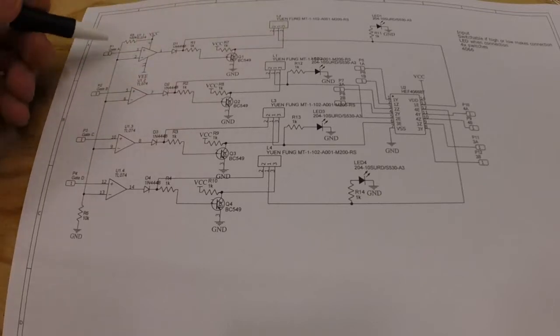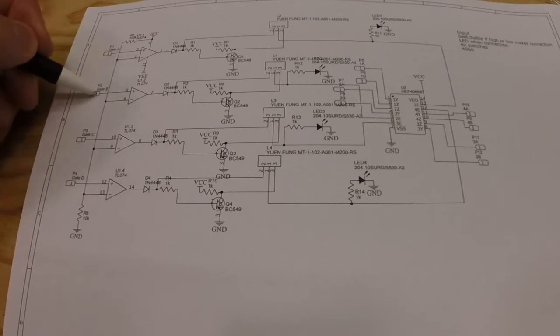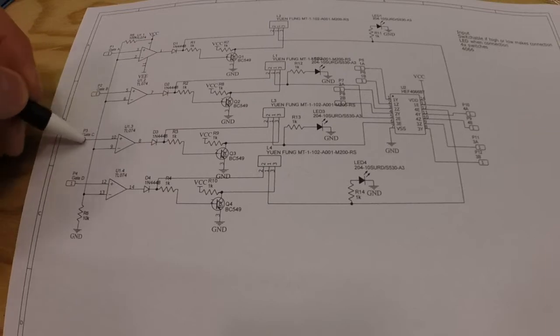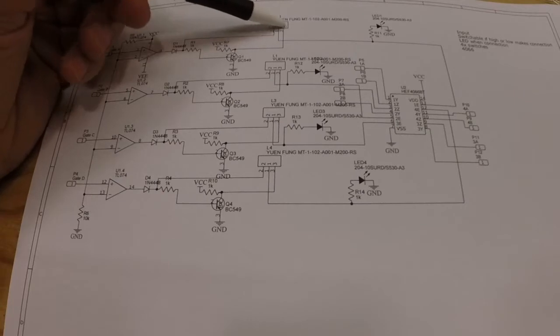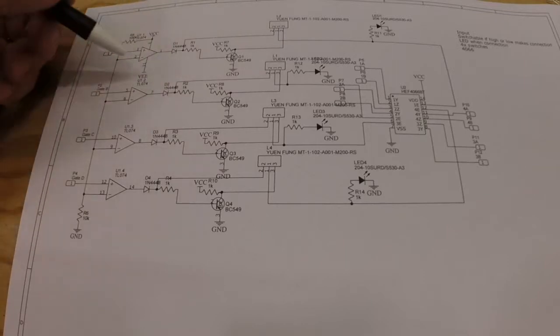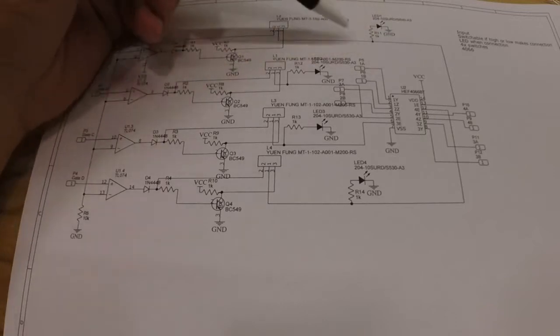Another thing that you can't see in the schematic is that I have normalled these gates so they're all connected together. When I connect a cable into gate A, it is also connected to all the B, C and D gates if there's not another cable in there. So it's those normally connected jacks here. And that's because that way you can take one of these switches and set it to be the on switch, when the gate is high, and the other one when the gate is low. That means that with one signal, it will switch between these two. I'll show that in the examples in a bit.